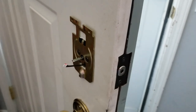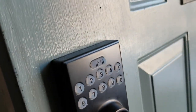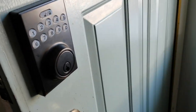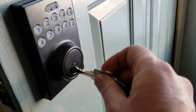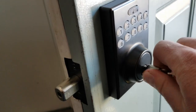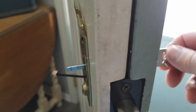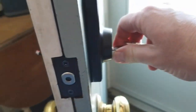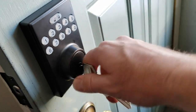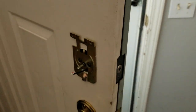That's completely flush — both screws are in there now and it's flush against the door with no spaces at the bottom. I'm going to take our key and give this a quick turn to make sure everything's working. The deadlock comes out and our little locking rod is going back and forth — good to go from here. I'm going to pull my key out and get that back piece mounted on now.